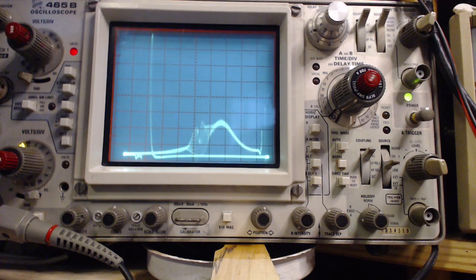Marker generator's at 100 kilohertz. I'm just going to take it up, up, up and see what happens. Nothing's happening. I got to 200 kilohertz — nothing happening. So the signal's very low. I'm going to go back down to 100; that's where I want the pips to be, every 100 kilohertz across that display. I'm going to start jacking up the output. That's 10 times, that's 100 times stronger. I only have one more setting, but it usually does the trick. I don't see a thing. I'm going to start waving the frequency around on the marker generator to see if we can get anywhere. Getting nowhere with it.